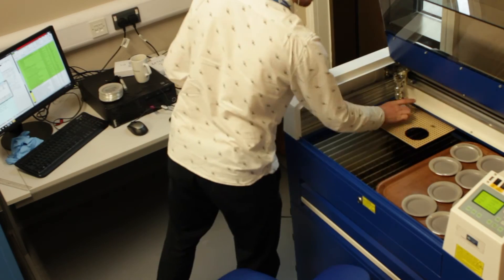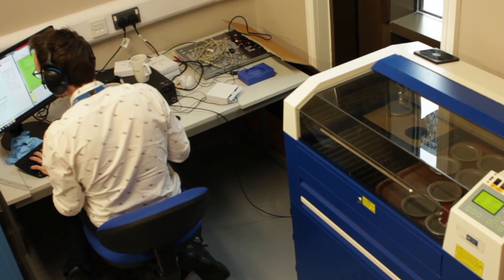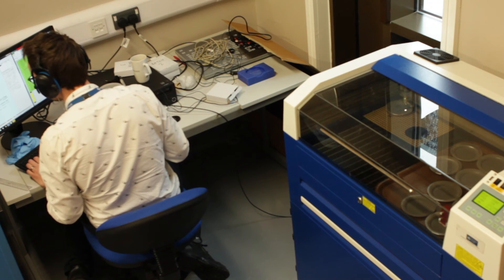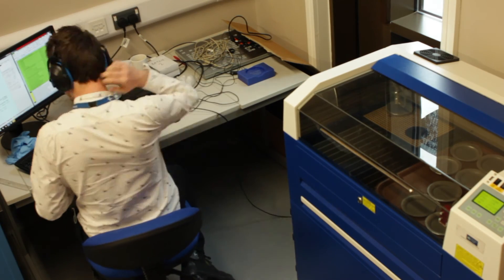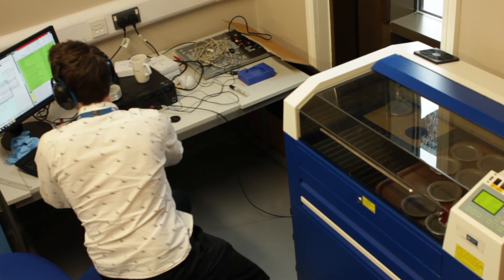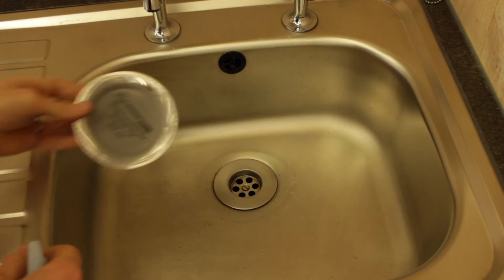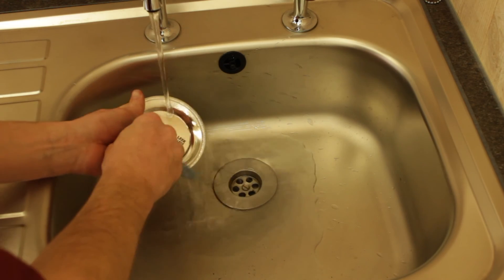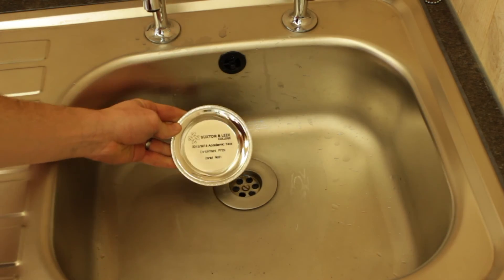We settled on 100% power on a 50-watt laser at speed 45, which worked out all right. This is just a quick overview of my workflow — it had to be efficient as there were 200 to do, and we ended up getting through them in just a little over nine hours. The final result was absolutely stunning; the best way to get the spray off is just with a little water. We dedicated that job to our marketing team, and it's an absolutely fantastic finish — the Cermark spray is to be recommended.